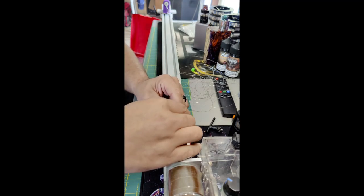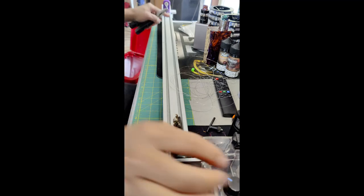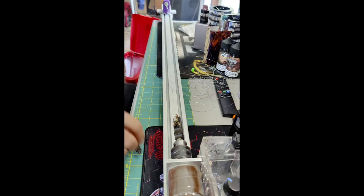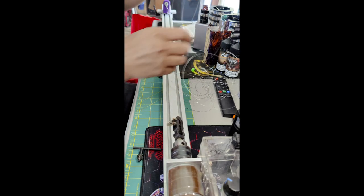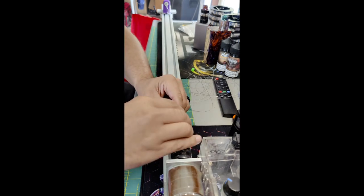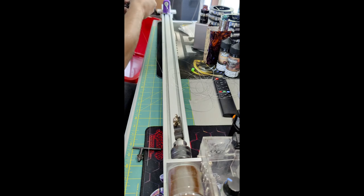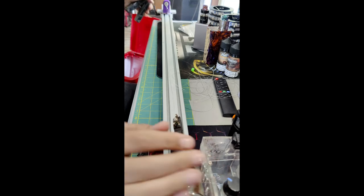Obviously, you take one end of your wire, clamp down on it in a little vise, other end of the wire, pair of pliers. That's it. Slight little pull. It doesn't take much to get the roll or the memory out of the wire. You're not looking to stretch it per se, where it actually changes the diameter of the wire. You're just getting that little roll out of it. Again, little pinch, little pull.